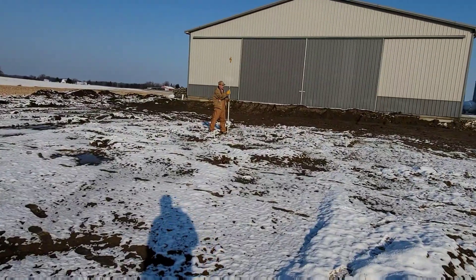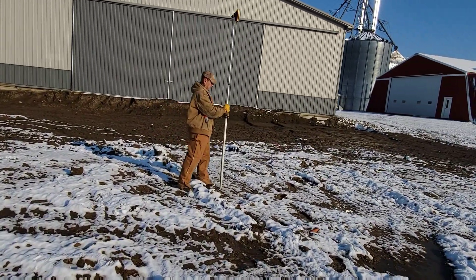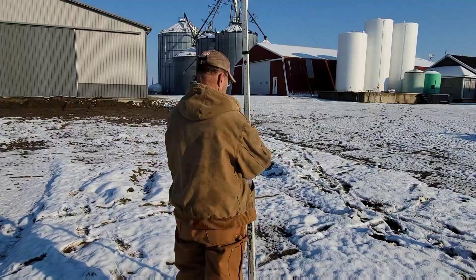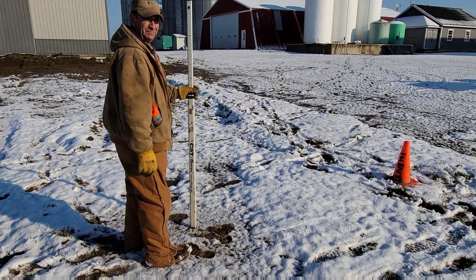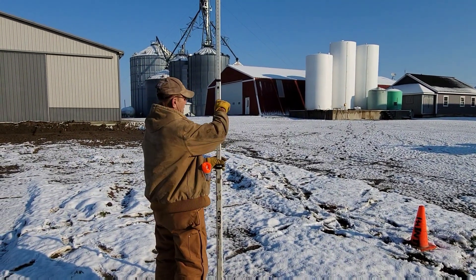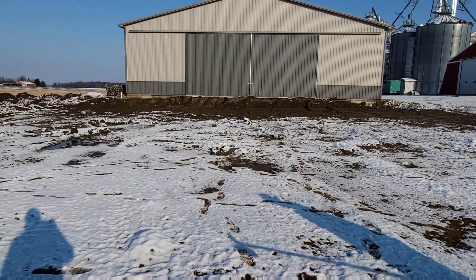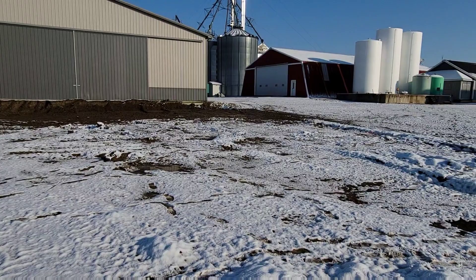What do we got down here, Dad? Well, there he's right in the center — that's a foot of fill. Nine to three, so he's nine to three there. We've got to be — what's our stone height supposed to be? Seven to seven? Or seven to five? Figure six inch floor, so that'd be seven to seven. So you're 18 inches of fill right there, and we haven't taken hardly anything off of there. That's why we're not making the floor heights the same, because if we went another two foot on top of there to get the floor heights level, you'd have three and a half, almost four feet of fill on this end without having stripped hardly anything off of it. So it's just not practical — there's no way that's gonna work.